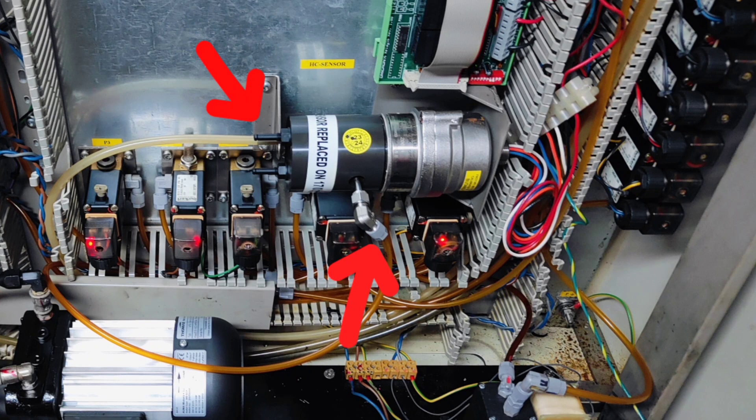Basically what you have to do is go to the local cabinet in the foam room. You can see the marked line - you have to clean all the hoses which are connected to the HC sensor and check there is no leakage and they are properly connected. Most of the time in vibration or maybe a ruptured pipe there will be a leak. Try to rectify that problem; otherwise you need to change the sensor. Check for any leak and check the sensor; if you have a spare, change it.